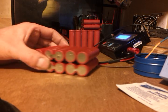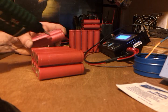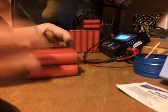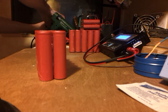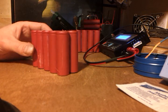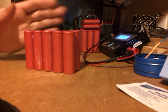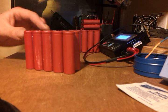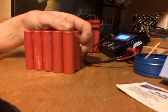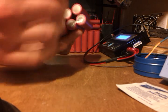Stick these two on the end. So that's how I'm putting them together — that's giving me, when I've finished soldering it, five cells in parallel times two, so ten cells all paralleled up. That'll give me about 3.7 nominal voltage. Actually wait — it's 20 amp hours, not 10. I was wrong. So: 20 amp hours, 3.7 volt.